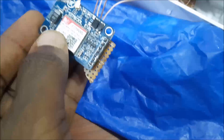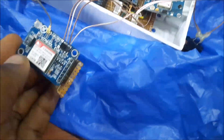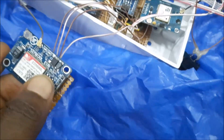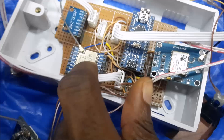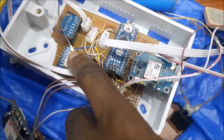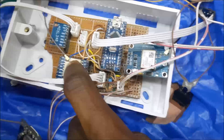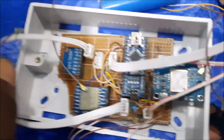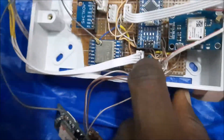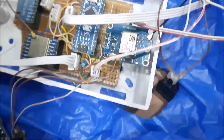Here is the transmitter — over here you have your GSM module, this is the EVB type. This one works on five volts but it is the same SIM800 module. This is the LoRa module, and unlike the other one, this one works on 433 MHz while the other is 868 MHz, but this one can travel up to ten kilometers in distance. We have already attached the antenna for it. This one is your DHT11 sensor and we have already soldered the pull-up resistor, because if you don't put a pull-up resistor it won't work. Here is your microcontroller, which is the brain of the project.